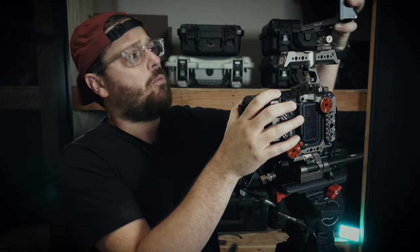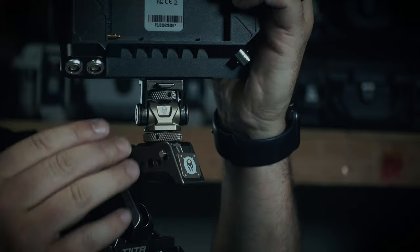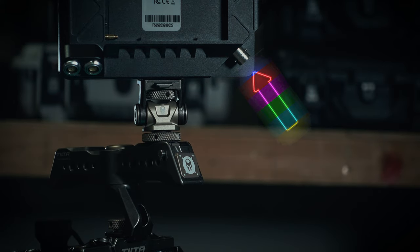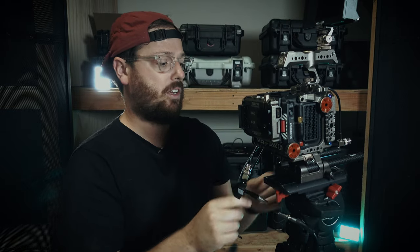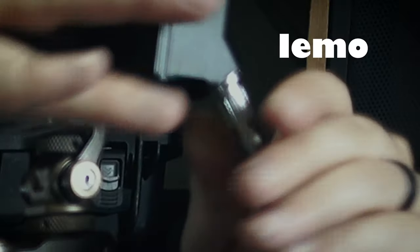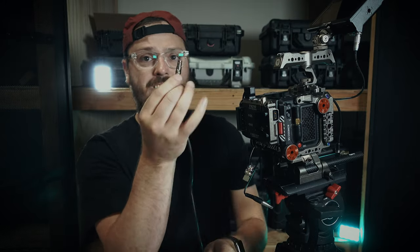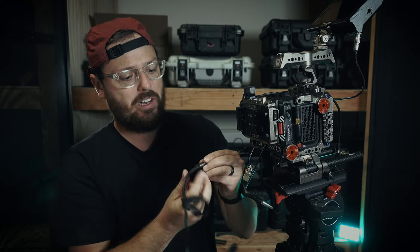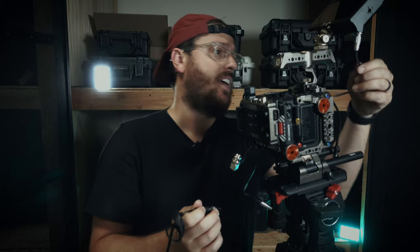For instance, we have our monitor. We want to power it on. The first thing we do is make sure we don't have any SDI cables connected. So right now, the SDI cables here are disconnected. We just plug in the power — the P-tap here to P-tap here. It's just plugged in but not powered yet. We actually need to power it. I have my power cable here — handy-dandy red Komodo power cable. This is the safe way to do it. SDI cable is unplugged. Now I'm going to power it on.